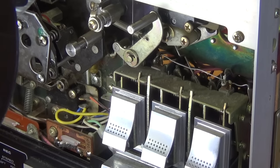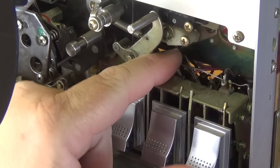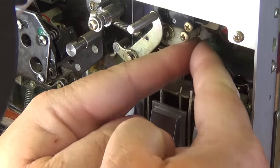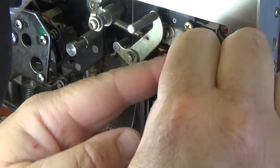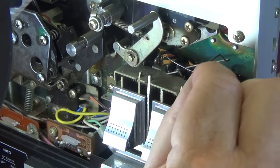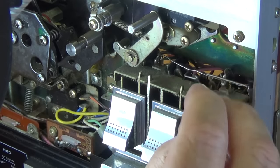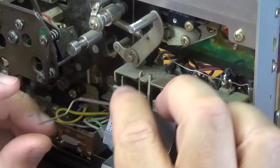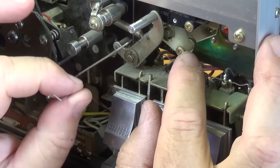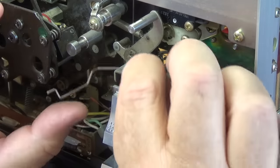I found it. That's where video evidence comes in kind of nice, because I couldn't find it on the floor. I'm just looking for a pair of needle-nose pliers so I can dig it out — it's right here. You see it there? It's dropped in behind here. There is the lever — it just flipped in and by fluke got stuck. That's the lever that detects where the tape is. It attaches to this arm and rides up and down on the tape like this.